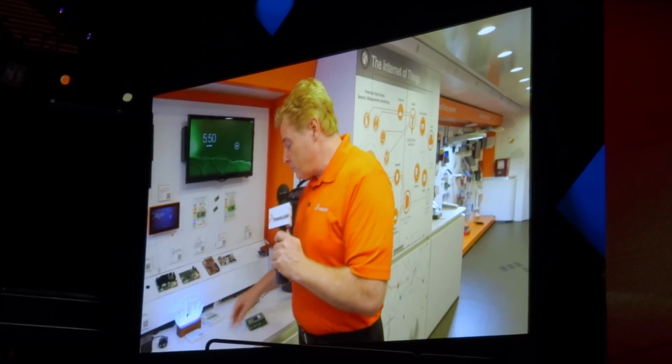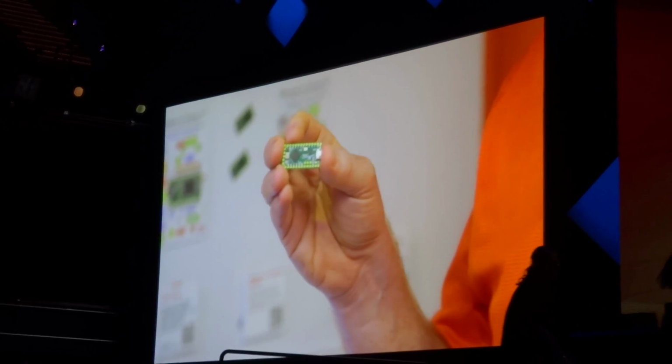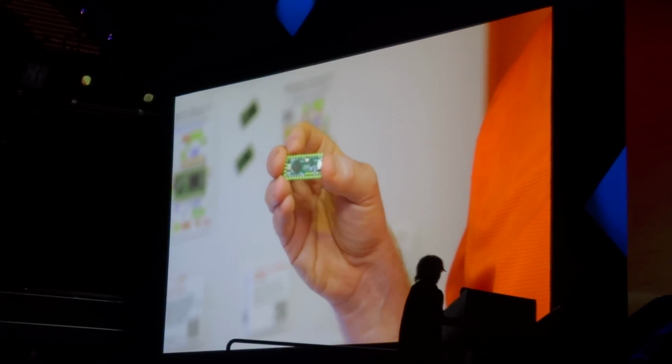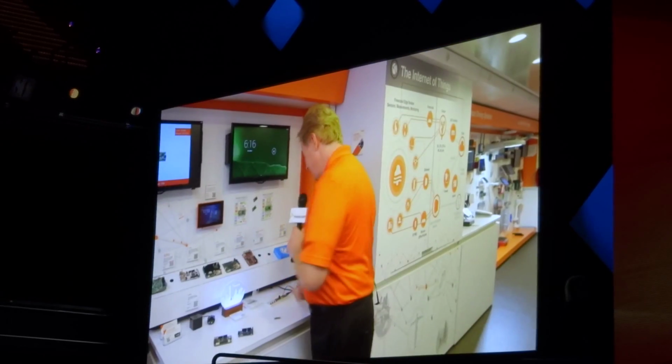And then for really getting started with microcontrollers, we've got a Teensy board. And this is from a company called PJRC. And they've taken all the Arduino code and really enhanced it to give the feature set of the Kinetis board, make that really stand out. So things like DMA transfers, and they've got great sound libraries as well.